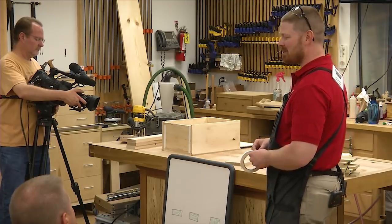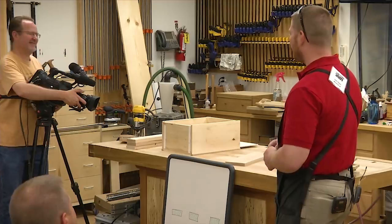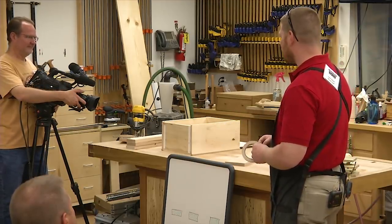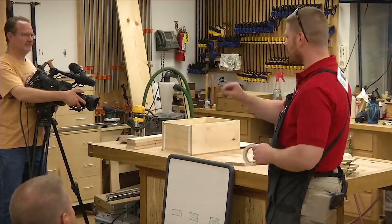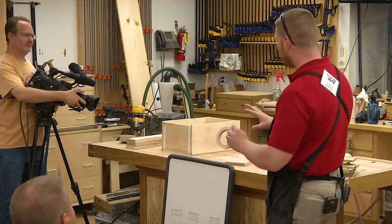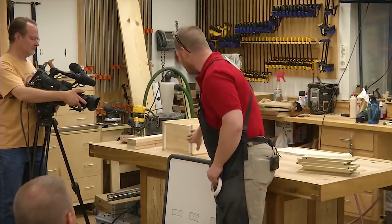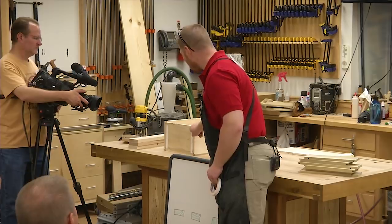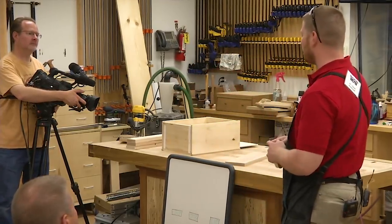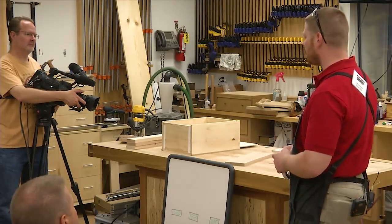A lot of our photos, you'll see us using pennies as spacers because we figure people can afford those. And you can use shims, you can use playing cards, however many playing cards you want, left to right, top to bottom, and then just push that drawer, that false front, against the drawer after you peel the backing off, and it should stick on there. Give it some good pressure, and then very carefully pull the whole unit out.